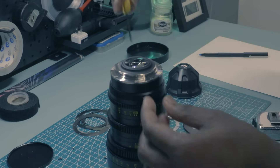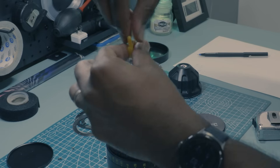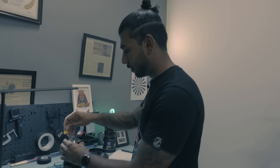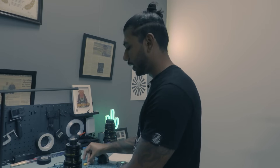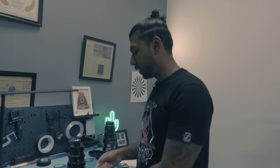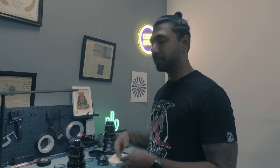Let's get back to removing shims. I'm going to start the process of taking off these screws — and this is why you want to start by only tightening two screws, because it becomes so much easier. The next thing we're going to do is take off most of the shims and just put a 0.5 on there. There's no real way to exactly pinpoint how many shims you need — it's more of a trial and error method. Now I've found a spot where S2 is greater than S1.